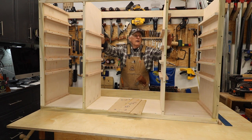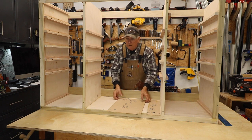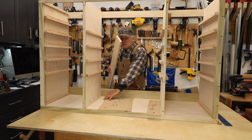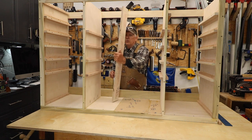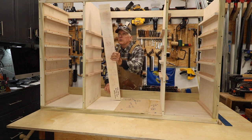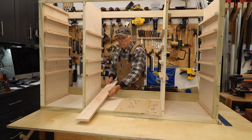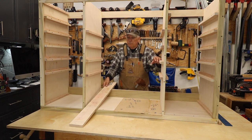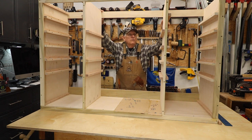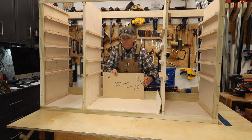On the cleat design, the two middle panels get one-inch-wide, three-quarter-inch-thick poplar cleats. To place them correctly, I laid out everything mathematically in my plans, then double-checked using a story stick — just a piece of plywood marked with all the measurements from the plan — and compared it against the actual carcass to verify the math worked out before installing any cleats.